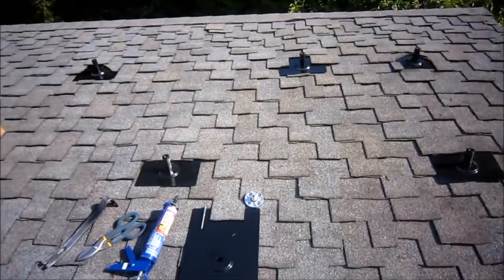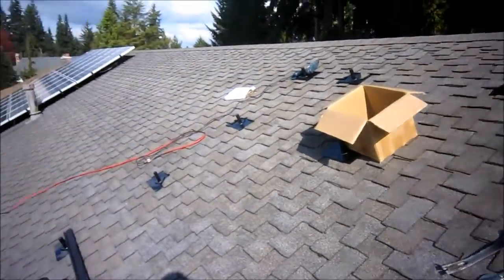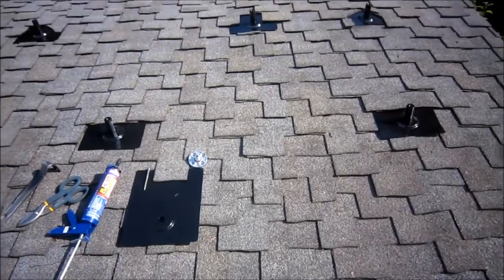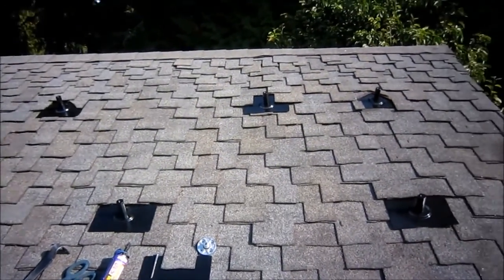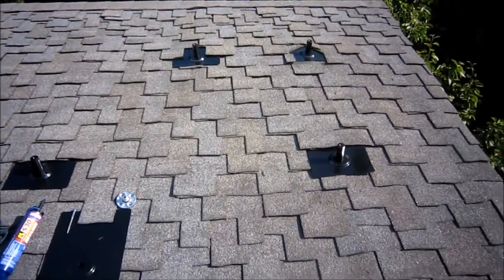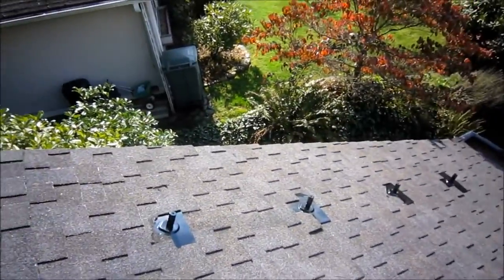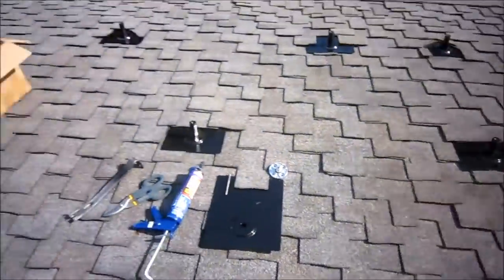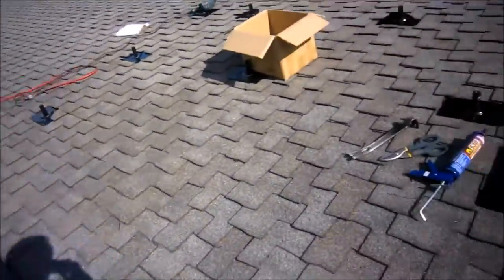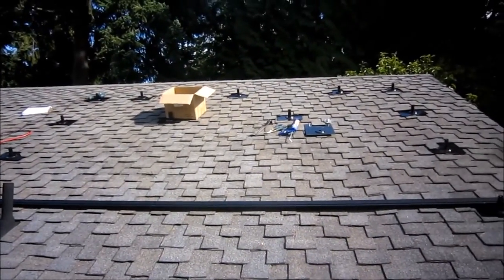You can see I've been doing this for a while this morning — about halfway done. Those are the panels on the far side of the house, so we're trying to do that again over here. There's a specific pattern: all the ones on the outside are flush with the outside of the roof, and I measured those off. I've also installed them on the other side of the roof, and I can use a rail as a ruler across the roof to get my heights.